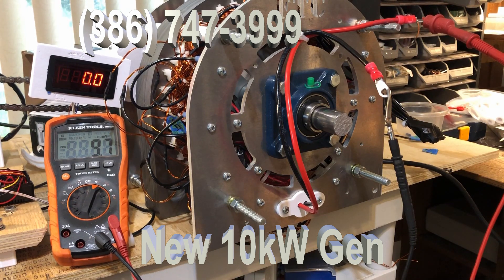We're going to have dual 5-kilowatt inverters that produce 240 split phase or 50 Hz at 230 volts. The reason we had to develop this generator is these new inverters also charge batteries. You don't need a battery to run it, but if you have batteries, this generator is powerful enough to run your house and charge the batteries. When the batteries are charged, the engine shuts down; then the batteries run the house until they're depleted and the engine starts up again.